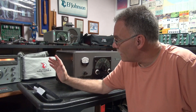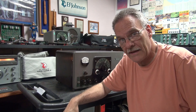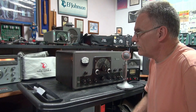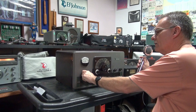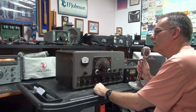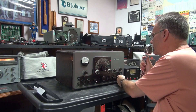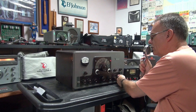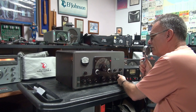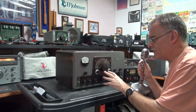So we're going to listen on the NC300. We're at approximately 3.8 megahertz, 80 meter band. I'll get the Valiant ready and we'll listen to that audio. We're monitoring on the NC300, 80 meter band. I've got the Valiant all tuned up. Got our 8 milliamps of grid, about 300 milliamps of plate. Hello, one, two, three, four — and there is the audio. Plenty of modulation on this guy. She's a screamer! Let me cut and I'll show you the metering and the power out.